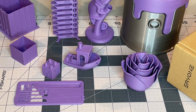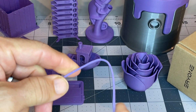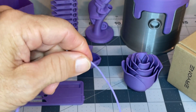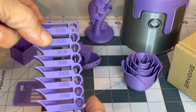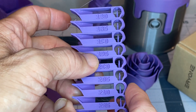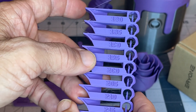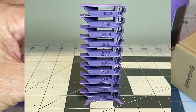It was a little bit different. As I saw at the beginning, it's not as flexible and bendy as a lot of other filaments. I did the temp tower of course, tried to go fairly low, settled on 195°C. Maybe could have gone a little lower, but it also just looked to get hairier as it got cooler, ironically. The flow was pretty much dead on to what I'm usually printing.